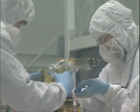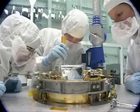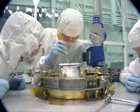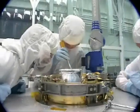These filters are very, very thin, and even just one tiny particle, too small to see, could penetrate them during launch when it's being shaken around. So we had to keep everything scrupulously clean, which means doing everything that has to do with the inside of the detector assembly in a clean room.